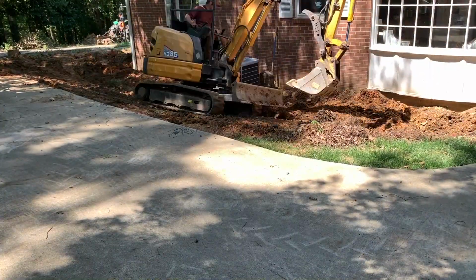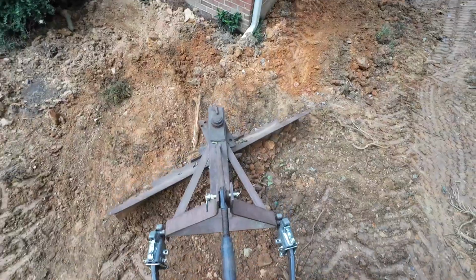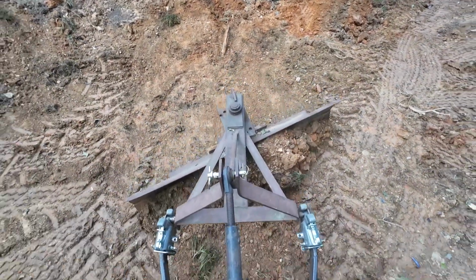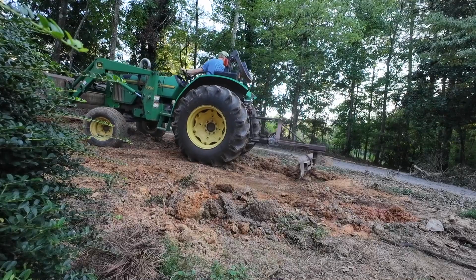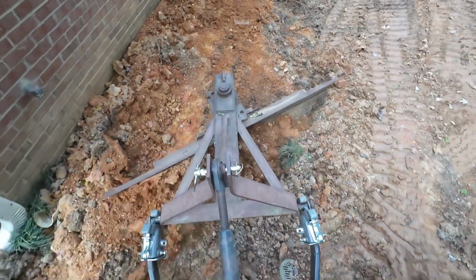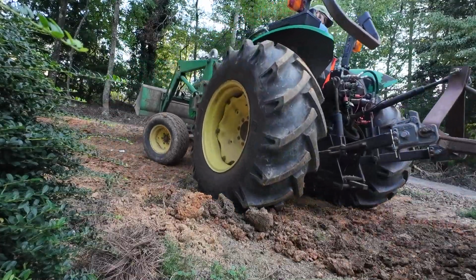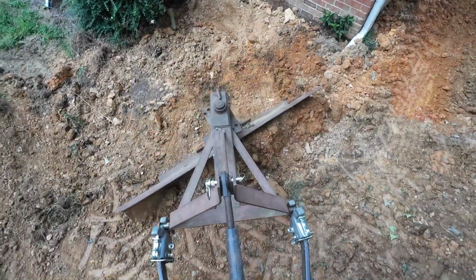Where we left off in this yard on Monday, everything was very rough and muddy. We weren't able to get it to final grade. There was rain in the weather forecast for Saturday afternoon, so we let it dry until Thursday. On Thursday, we took the tractor with the blade and just tried to turn over the wetter parts and see if we could get them to dry out. Actually relatively dry by Thursday, so the goal to get it finished up on Friday seemed achievable.